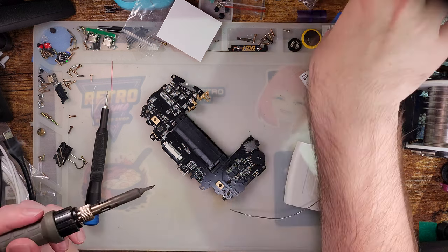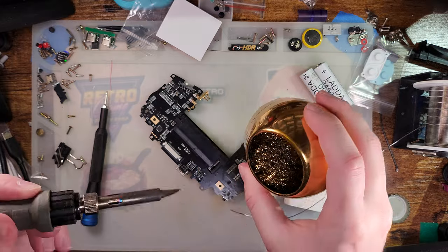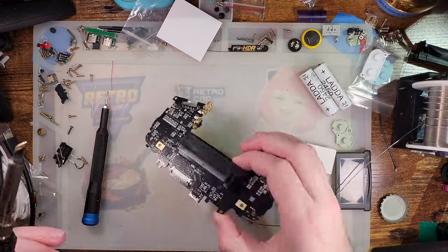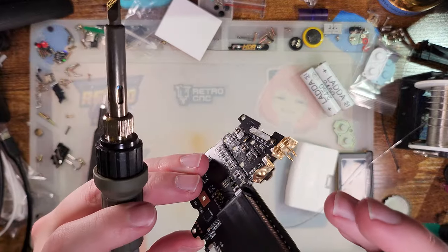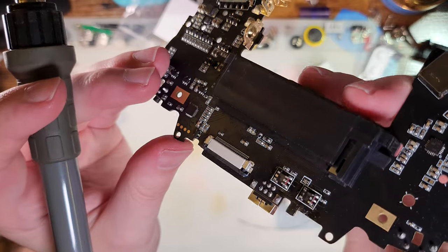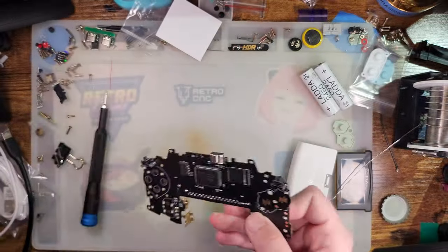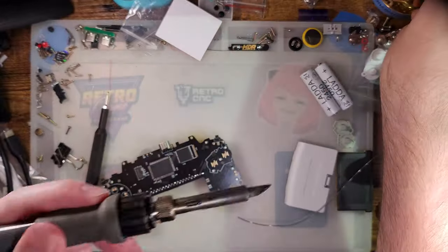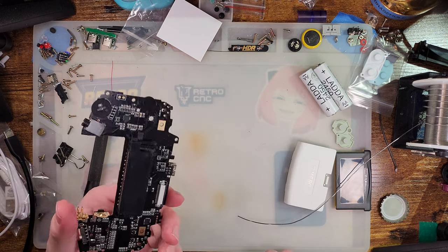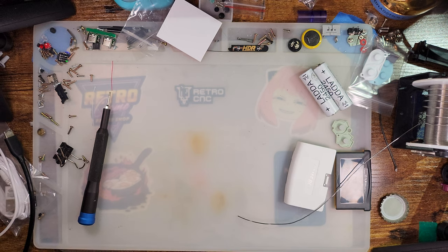I'll just keep feeding fresh solder in until it works. And there we go. That should be it, at least for this one. See, I've got nice clean fillets on there. And so this board, if it didn't work, it should now, at least with the link port. Ta-da! Easy peasy. Next, let us discuss...